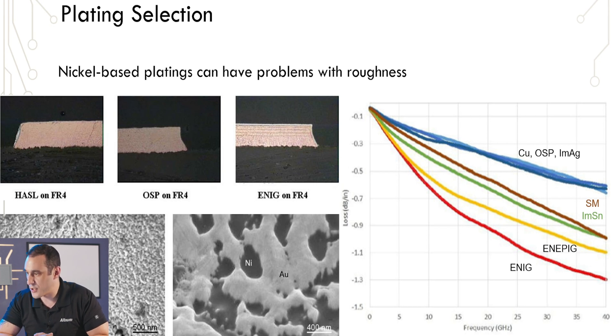At low enough frequency you're probably not going to notice much of a difference, but once you get into the 10 or 20 gigahertz range, you start to see a very significant difference in insertion loss. The bottom two curves for ENIG and ENEPIG are nickel-containing surface platings — they have a bit of additional roughness due to the interface between nickel and gold, and they incur additional loss due to the fact that nickel is ferromagnetic, giving it some additional magnetic loss. Up at the top of this graph, we have some overlapping blue curves for copper, OSP, and immersion silver — basically OSP and immersion silver have comparable loss to bare copper. In the middle, we have a typical solder mask curve and immersion tin as a mid-range loss plating. If you want to learn more, take a look at the IEEE article linked in the description.